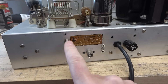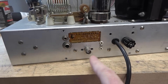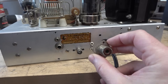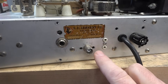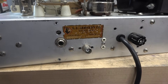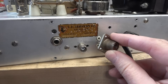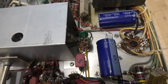On the backside, I'm removing this 1/8-inch jack and the coax that goes into the VFO. The owner asked me to remove the BNC jack and install a nice original Amphenol SO239. Originally the Navigator had a little RCA jack which was not very robust, so that is why we're replacing it with a good old SO239, just like the Rangers and other transmitters use.